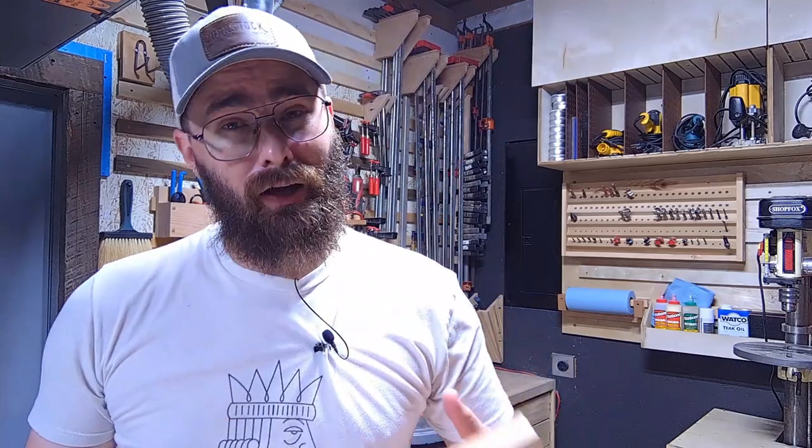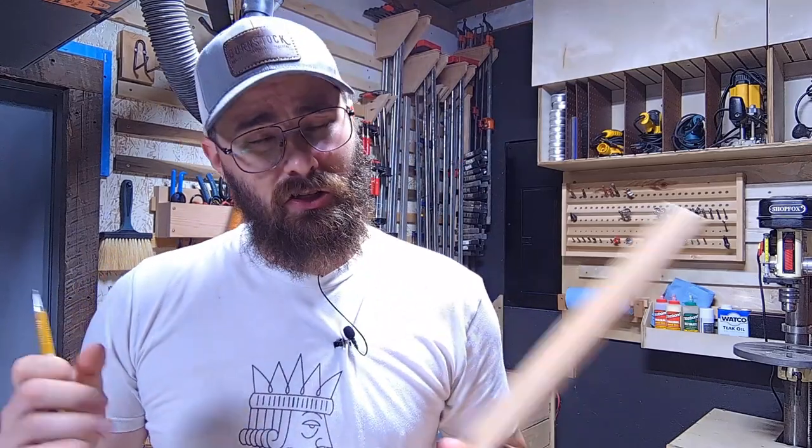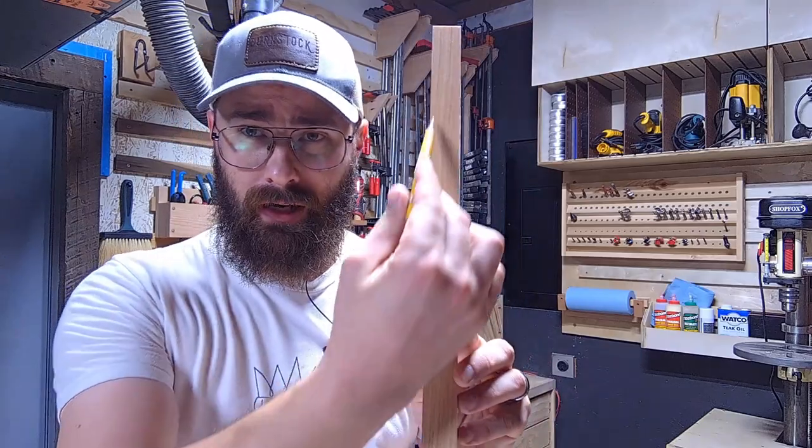The timely change or sharpening of your table saw blade is absolutely essential, both for safety and for the preservation of the work piece. You don't want to damage the work piece, especially due to your negligence of your blade. When selecting a blade, you first have to figure out what type of cutting you're actually going to be doing — rip cutting or cross cutting. Rip cutting is cutting along the grain, and cross cutting is cutting across the grain. It doesn't sound like a big deal, but it makes a huge difference when selecting a table saw blade.